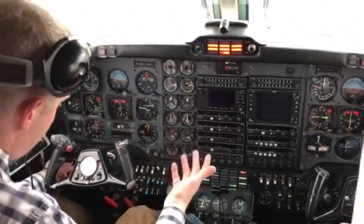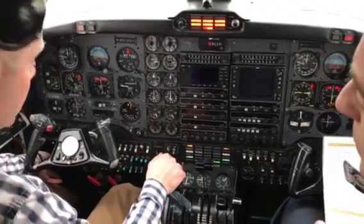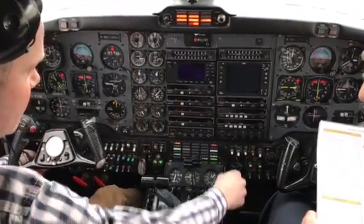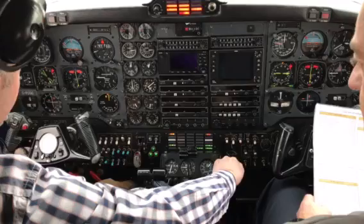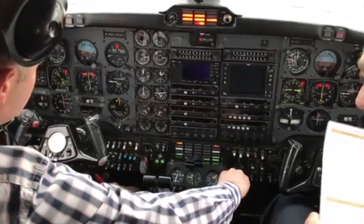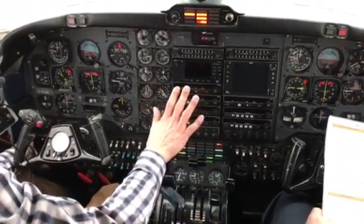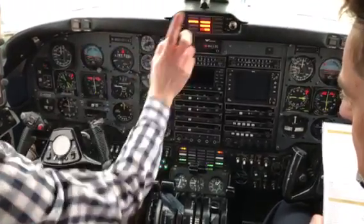So now I say starting number two — I'll walk, talk, and describe what's going on. I take my right ignition, keep my hand on it, go to the up position. Right ignition light — spool up. We're waiting for 16% N1. 16 — stable. I go to fuel cut off and crack it. Holding, waiting. Fuel flow — see where it is. Initial light off coming up. There's the secondaries, a little early today. Watching the ITT — it will go above the red line. 50%, comes off.